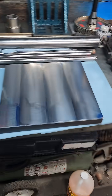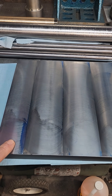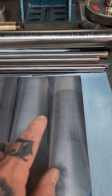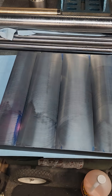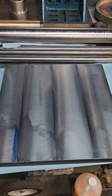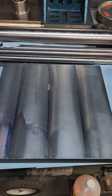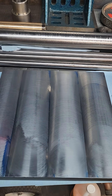When you put your plate on there, you get the marking which shows you where your high spots are. So I'm going to need to scrape those high spots down, and then put that plate back on the surface plate to see where the new high spots are. I'm going to have to keep working on those high spots until I have a uniform average across the plate.